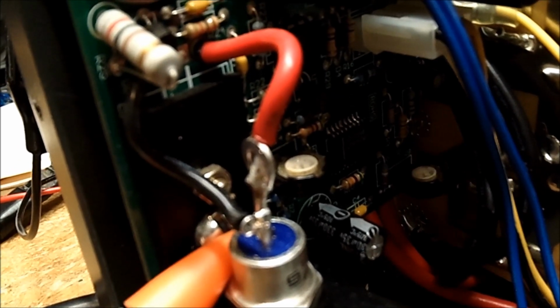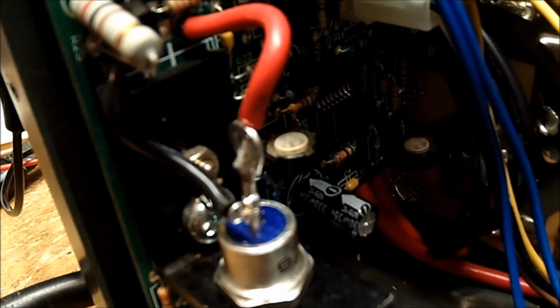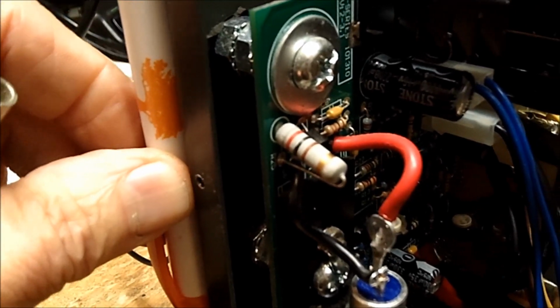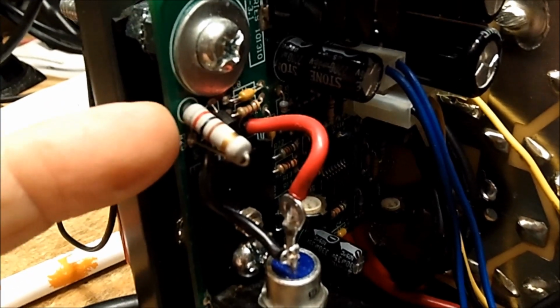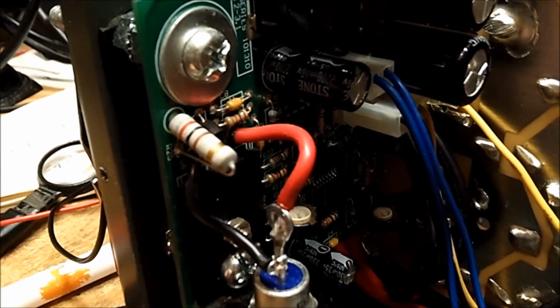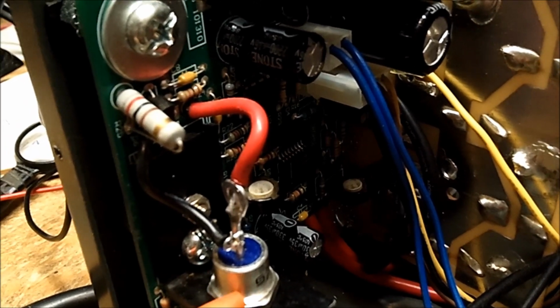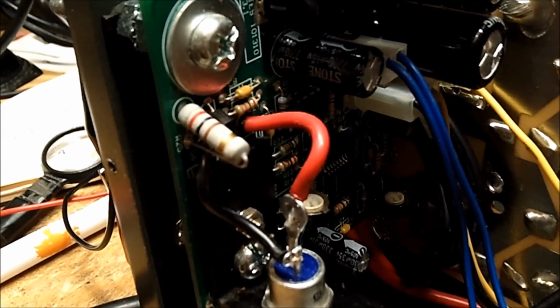Because this is supposed to be, from what I understand, I think this is an SCR, and, off camera again, it's a crowbar circuit. A crowbar circuit means you literally throw a crowbar, it's a saying, across the output and short it out, in case the voltage goes too high. In other words, it's supposed to be 13.8 volts coming out. If it goes over that, I guess this little guy sacrificed itself, because there's no way this little SCR is going to pass 60 amps of current, maybe only once, and then that's the end of its life.